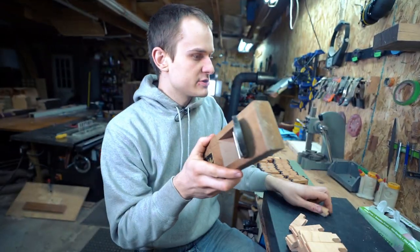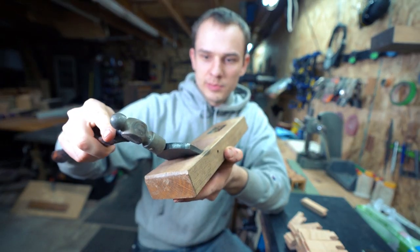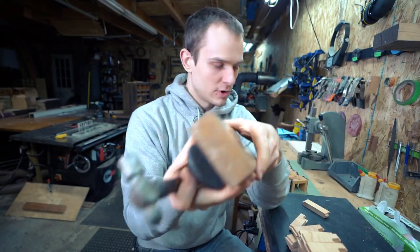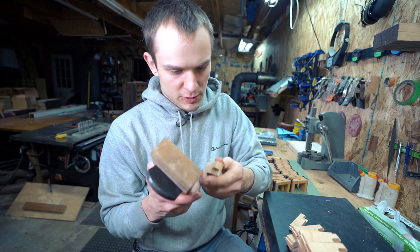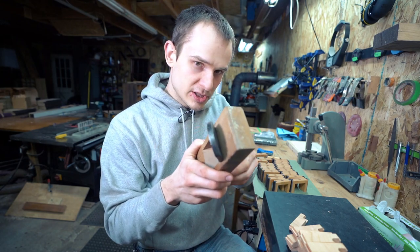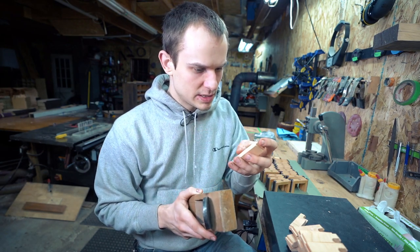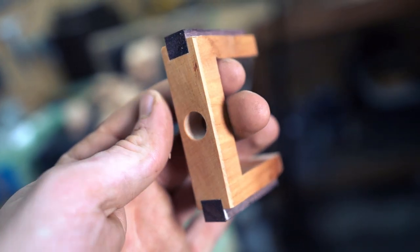So I just take this plane. The way you set this thing is you just take the hammer and tap it until the blade is protruding at about the approximate distance that you are looking for to give you a nice cut. The thinner shaving you take, the better the finish will be on the wood. If you take a deep cut you might be ripping out the fibers more easily. So I just do it pretty light and take two shavings, and that gives me that effect which works really well.